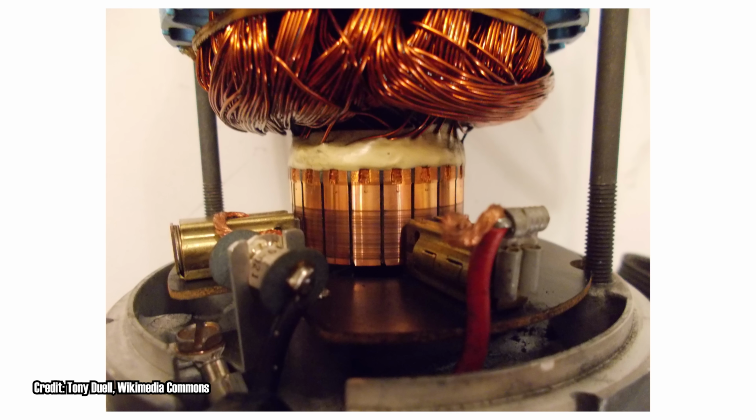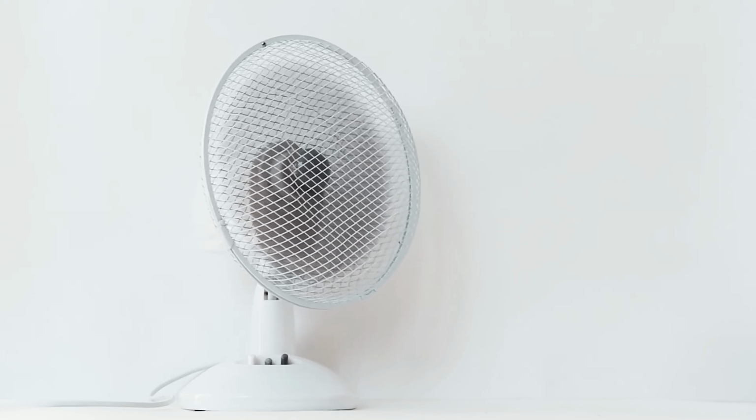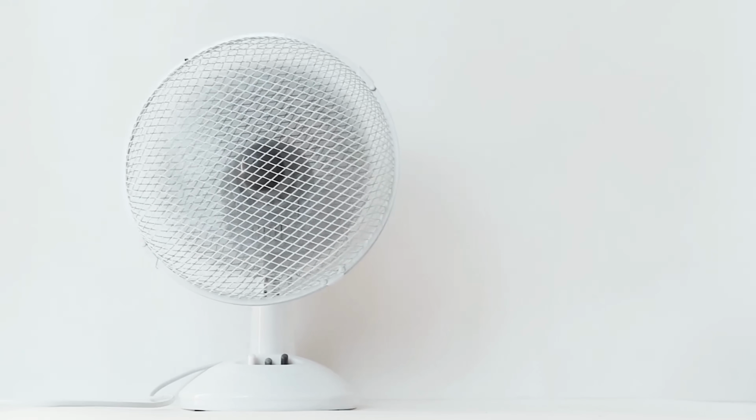But the carbon brushes, which carry current through the commutator, wear out over time. They're not usually super efficient. They create a lot of electrical and often audible noise. There's usually some arcing going on, and so they're typically only used in certain applications which don't run them for long periods at a time, like power tools or food processors. For something like a fan, which may run for days at a time, you'll want to use an induction motor. These don't have brushes that wear and will generally last as long as their mechanical bearings do.